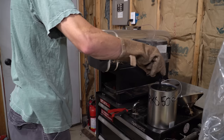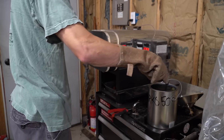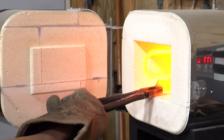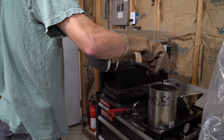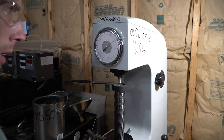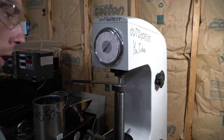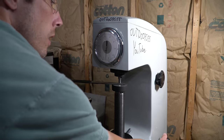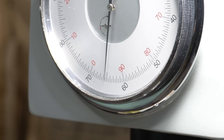Never had that happen before - not the fire, but it like welded itself to one of the ceramic pieces inside. It got stuck to it. And if you're curious what knife number three rocked at straight out of an 1800 degree quench, well here it is. We've got a touch over 65. Not surprising but interesting.